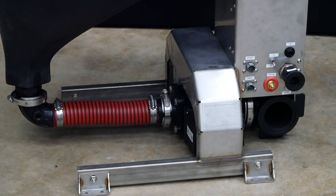We prefer about a 25-gallon-per-minute water supply at about 30 psi, which is a nice pressure. Typically this is supplied by a secondary pump — most commonly an additional 2-inch transfer pump. Some people use small gas engine 1-inch pumps, which are adequate. In stationary plants, a 1-inch electric-powered pump or a city water supply will work. The system also has the capability of controlling electric transfer pumps in a stationary plant situation, and motor starters can be connected to control high-voltage and high-power motors.